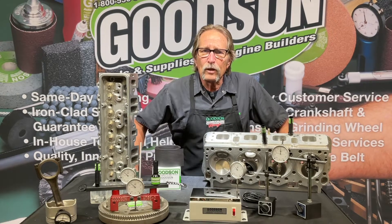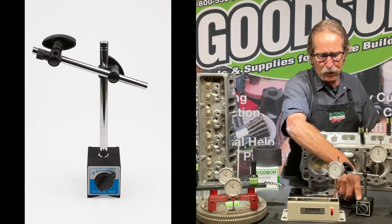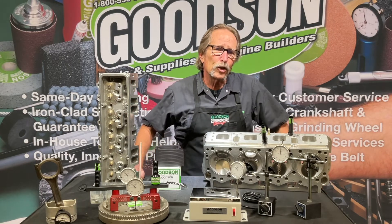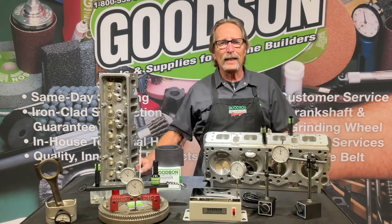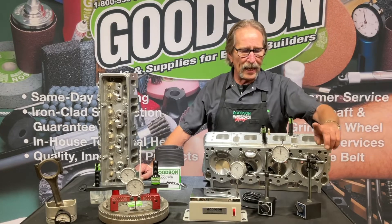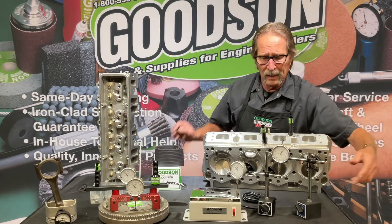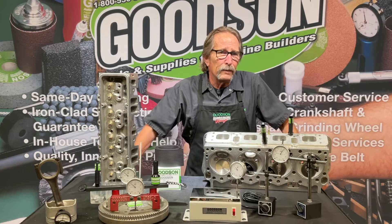There are other reasons you'll find a need for a magnetic base, and we offer not one but two different styles. The first one here is just a simple magnetic base — it's got an on and off switch. You can put it on a surface and then measure, moving that surface underneath the indicator to see if you have an uphill or a downhill situation. It's also good for putting on your surface grinding tables to make sure the table is moving across parallel and not having a rising or lowering situation on your V and flat way. The MBR1F is the brother of the MBR1, and what it gives us is a fine adjustment. You can fine tune that very easily with the knurled knob off to the left. I like this one because I do like that fine tuning capability right there on that MBR1F.